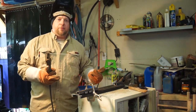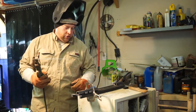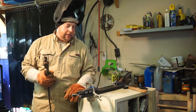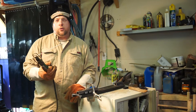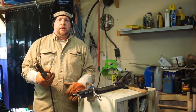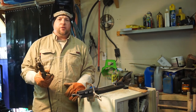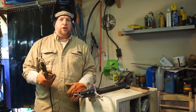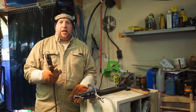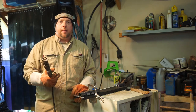Wear leather gloves to keep you safe from the current and the heat. Make sure you've got an adequate safety shield to protect your eyes. I've got pants and boots on so none of the sparks fly down on my legs. I'm using a 6013 rod, which is a good general-purpose welding rod — you can use AC or DC current with it. Make sure your welder and rod match. I'm using a 1/16th rod for more control without producing too much heat at the weld.